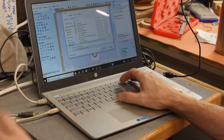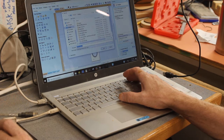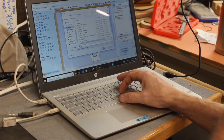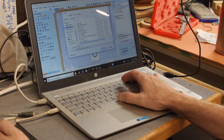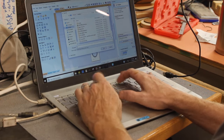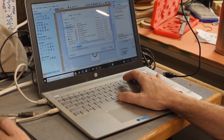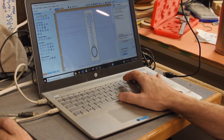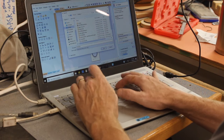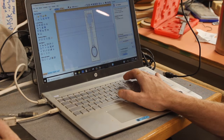Then I flip it over. My third path is the guide markers — 'three guides 25EM'. Fourth is the roughing — 'four rough 25EM'. Fifth is the finish — 'five finish 25BN' ball nose. And my final is the profile — 'six final profile 25EM'. Now we're ready to cut.